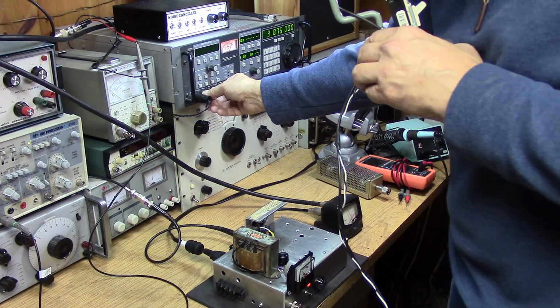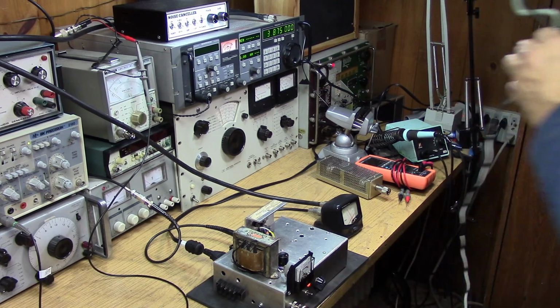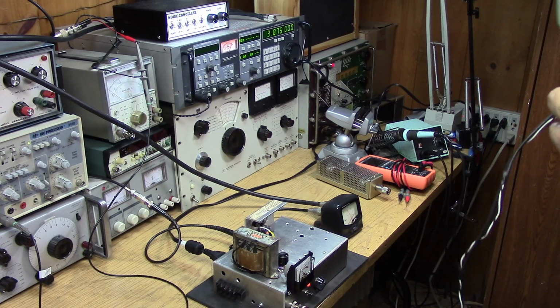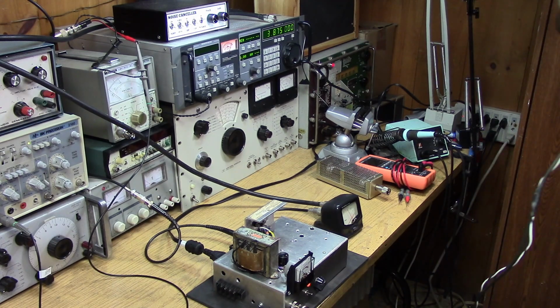Yeah, again, I'll get the thing straightened out, but it's just good to see it running. Again, about 10 watts out. This thing will do about 25 watts out with the 630s, and I cut it down to around the 40% level and let the PDM fill it in. So about 40% of the voltage is on the final. That's the way I'm setting it up. I don't know enough to know where I'm supposed to set the PDM. I'm just very happy it's working at all.